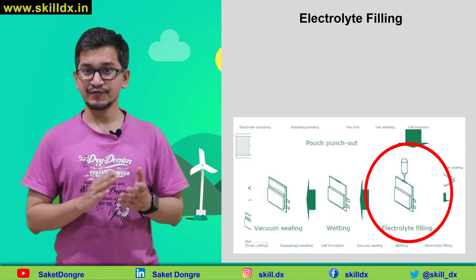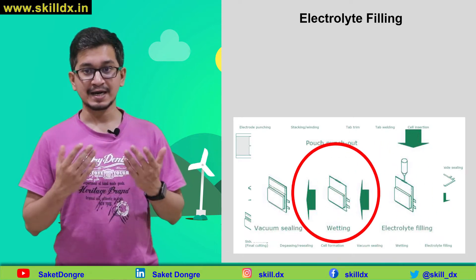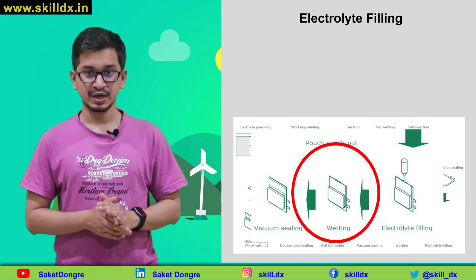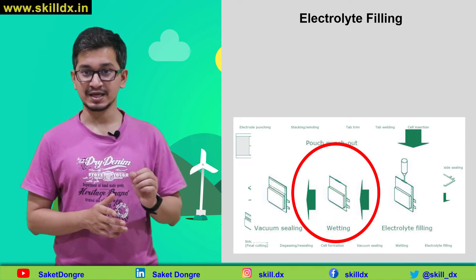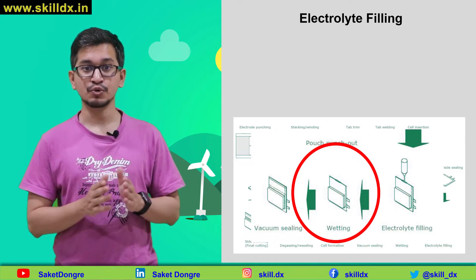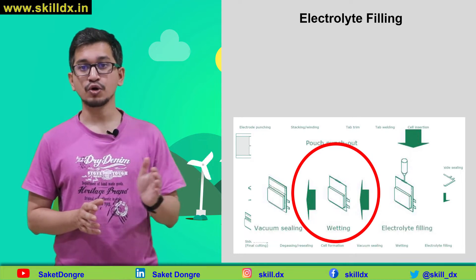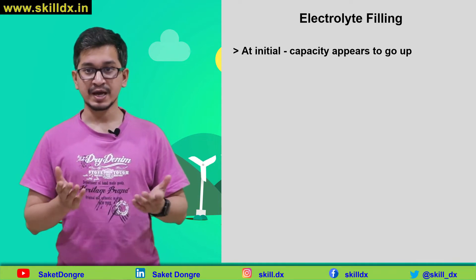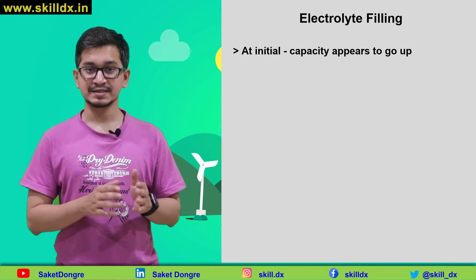It's interesting that even at this point the cell may not be completely wet with the electrolyte material, and it may take several charge or discharge cycles for that to happen. It's not uncommon to see the first several cycles of a new lithium-ion cell appear to increase in capacity as the electrolyte makes its way into all the pores and allows lithium ions to flow to all of the solid active material. Then after these initial cycles where capacity appears to be going up, it starts to go down as the cell ages.